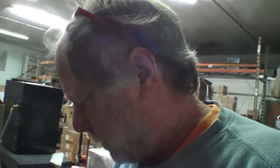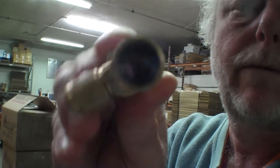It looks like the ball is in there. I set up a piece of tubing hooked to the shop vac and just went down like this and sucked that ball right up — that worked out really well. I took a quick look at the o-ring seal; I didn't see anything obviously wrong but it was covered with oil, so I wiped it, which might have dislodged whatever was there.